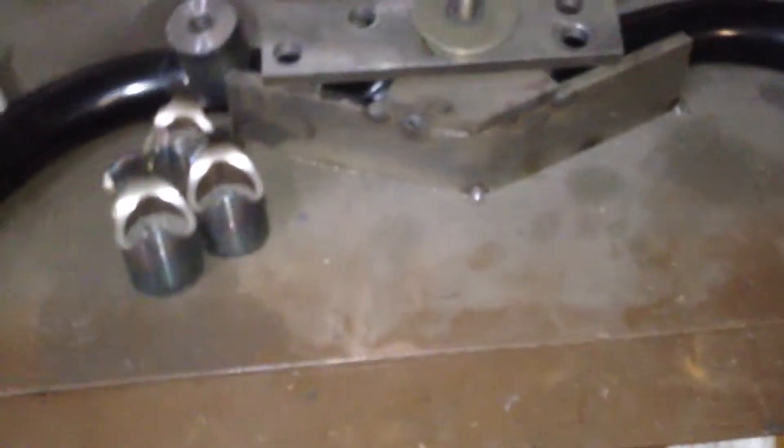Because it's notched, it goes onto the tubing. Some washers go on here — a couple more washers — and then you screw this plate down and it holds everything nice and tight. Then you can check real quick to make sure there's no gaps in the handlebar, and you can clamp the handlebar down to the plate that this is made to. And you can weld your handlebars up and they're right every time instead of guessing. But this jig only works for this handlebar, so I'll be showing a set of those being made.